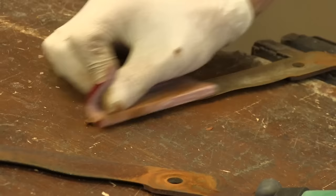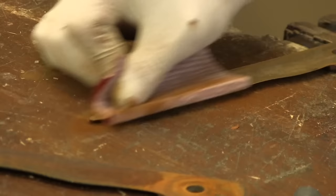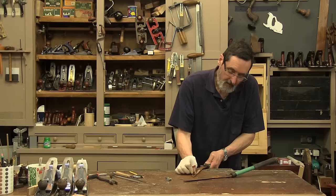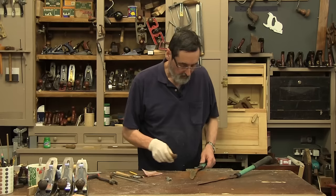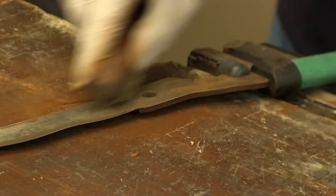We're getting rid of the rust on the outside, and then we're going to oil those faces just to make sure the rust doesn't deepen. From here on we're going to stay on top of these shears and they're going to stay in good shape for the rest of their life. In here you could use a wire brush if you have one — go in and remove that rust in between.